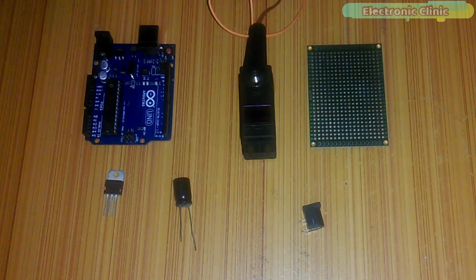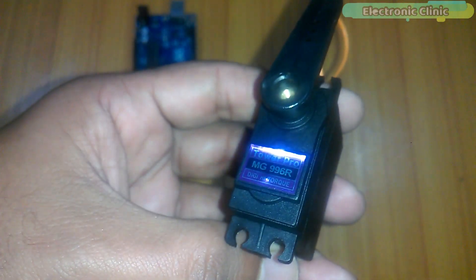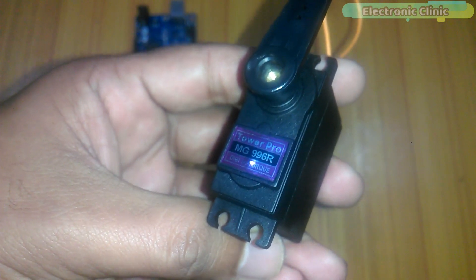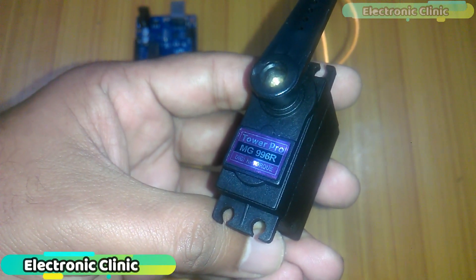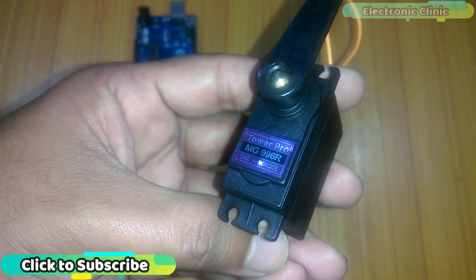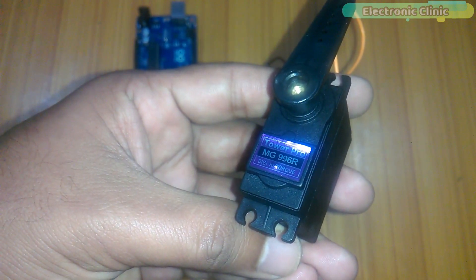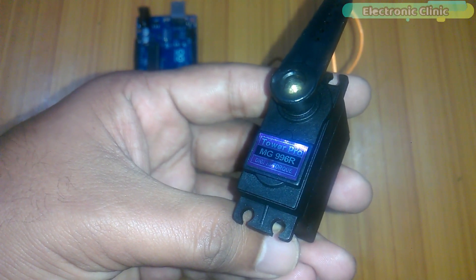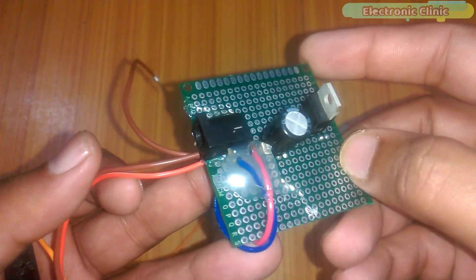These components can be purchased from Amazon — the purchase links are given in the description. Your servo may behave erratically, and you may find this only happens when the Arduino is plugged into certain USB ports. This is because the servo draws quite a lot of power, especially when the motor is starting up, and this sudden high demand can be enough to drop the voltage on the Arduino board so that it resets itself. The same thing happened to me — my Arduino was resetting and I wasn't able to achieve smooth movement and accurate positioning. I solved this problem by making an external power supply for my servo motor.